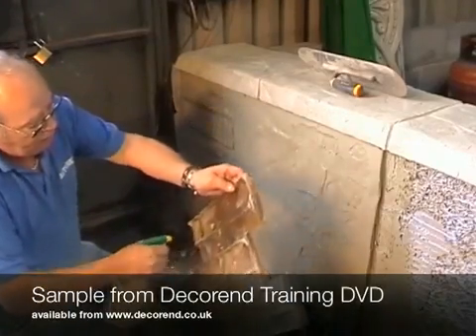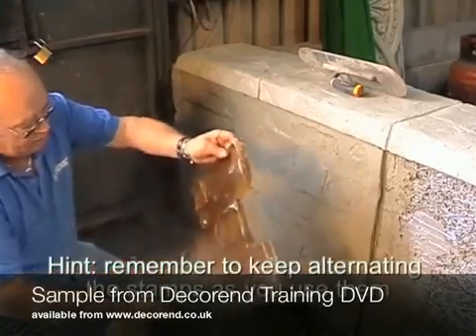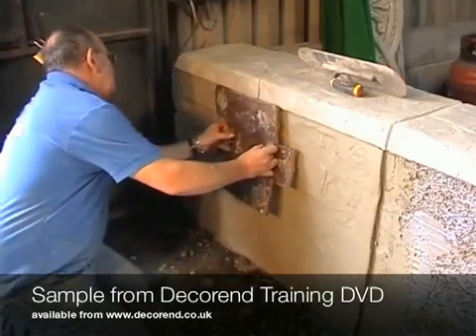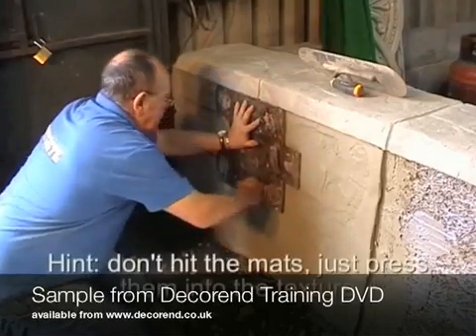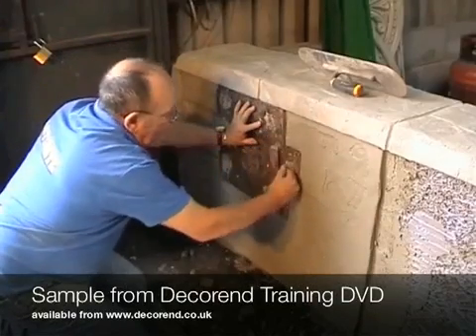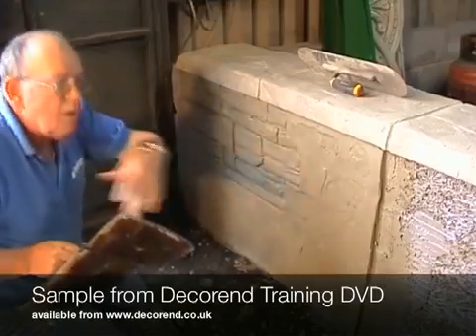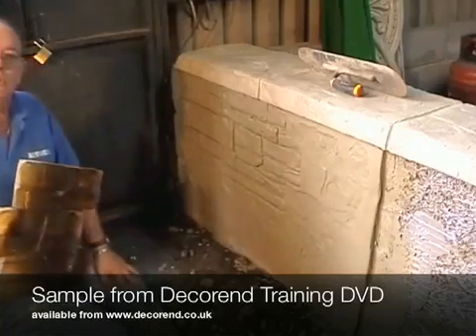This actually comes in a set of four, so you're going to keep mixing and matching them all the time. Come up to where you stamped last time, place it over where you can see the indentations are, and stamp it again. Don't let it slide - take it back off. We've got our stonework starting to come across the wall. Just work your way down the wall and within 20 minutes you've got yourself a really nice stone wall.